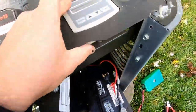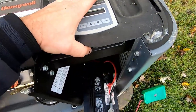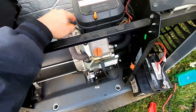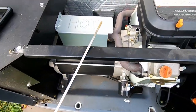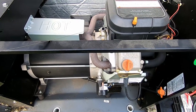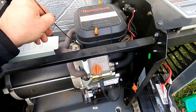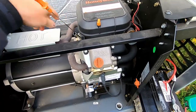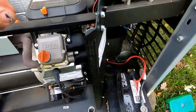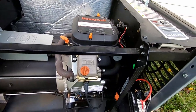The problem we had here was a low oil pressure switch. We could always try starting it after checking the oil level — our oil level is right there in the middle, we're fine there. While you're at it, you should probably also check your air filter and do a once-over on the whole generator to make sure there's nothing in your air vents — no grass, small animals, or anything like that stuck in your generator.